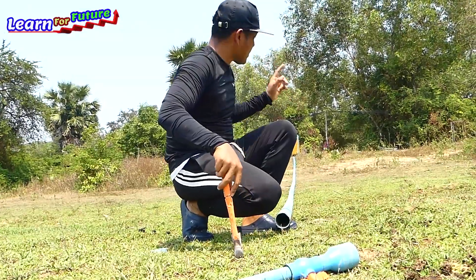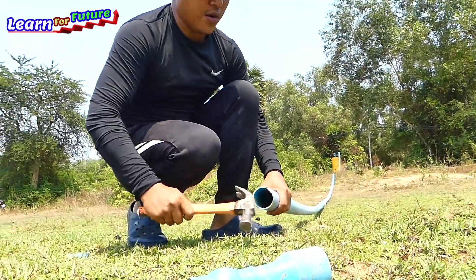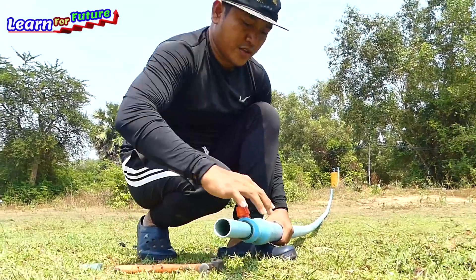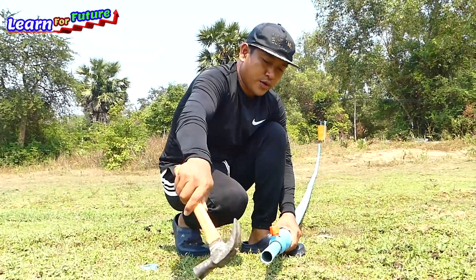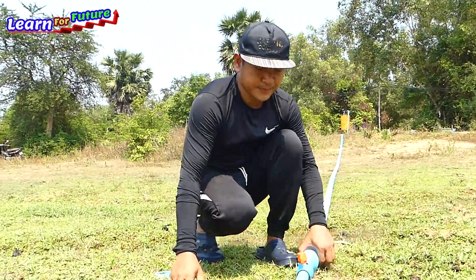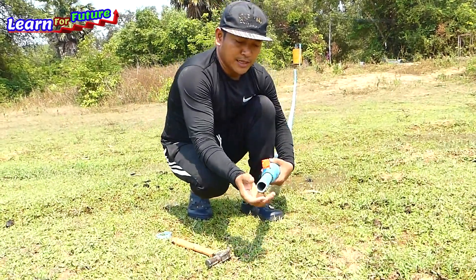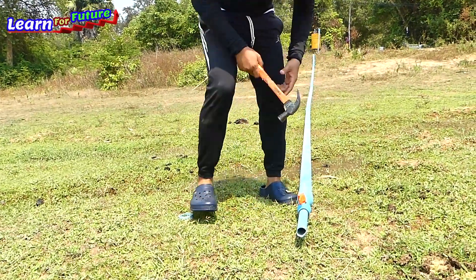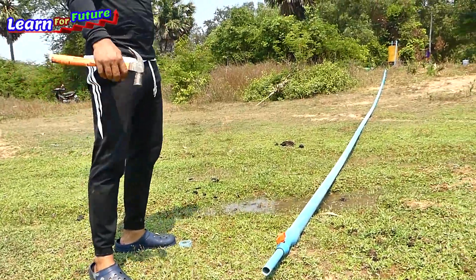From here to the drum is about 50 meters, because we want the water pressure strong and heavy enough to draw water from the drum, and the drum will get pressed and suck from the river. We put this one smaller at 34 millimeters because the intake water pipe is also 34 millimeters. We don't want to put it bigger because the drum will deform.